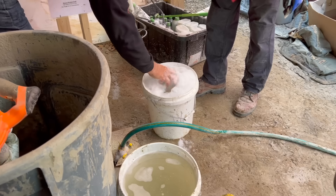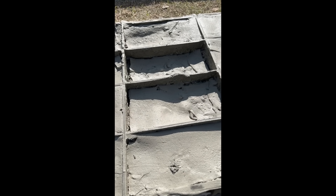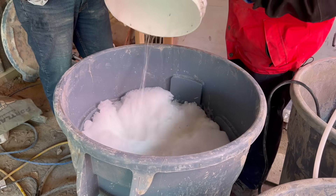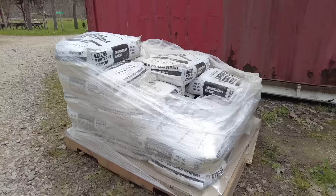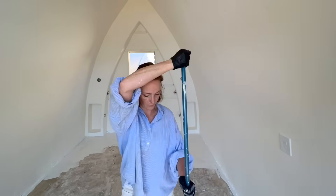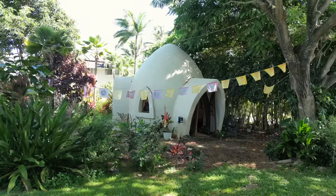Some challenges to building with aircrete: getting the recipe right the first time does take a little finesse, and getting your foam perfect takes some learning. The most common problem is the aircrete mixture collapsing, which is almost always due to low-quality foam that doesn't meet specifications or minerals in the water interfering with the foam. Very cold temperatures can also cause problems but can be counteracted with warm water. Once you get these things dialed in you can get very consistent results. You also have to lift bags of cement, and since it's a new process, people might look at you a little weird — but these challenges can be learned and overcome fairly easily.